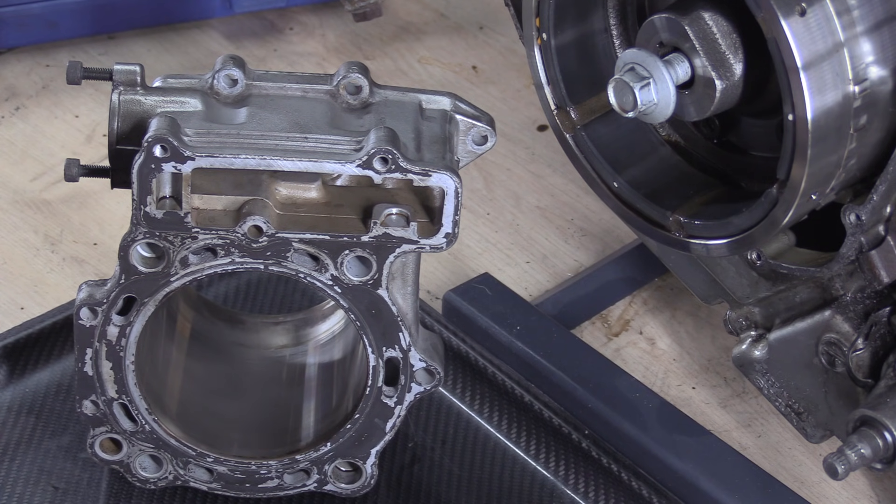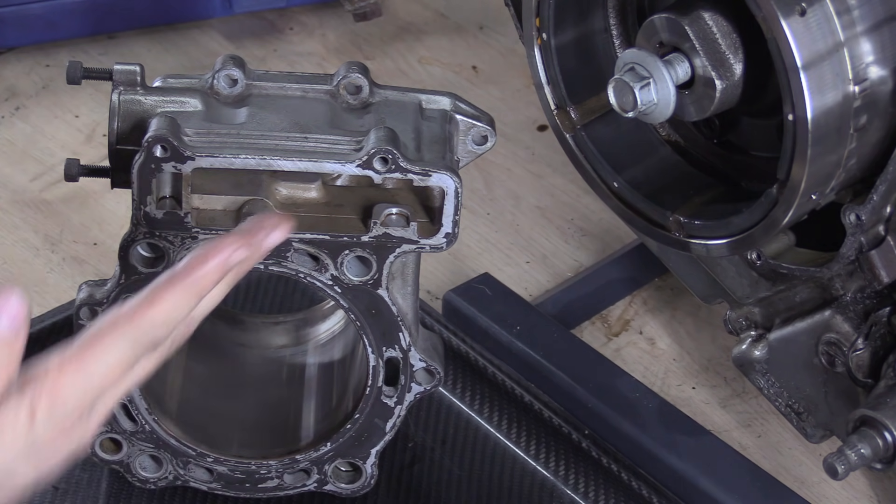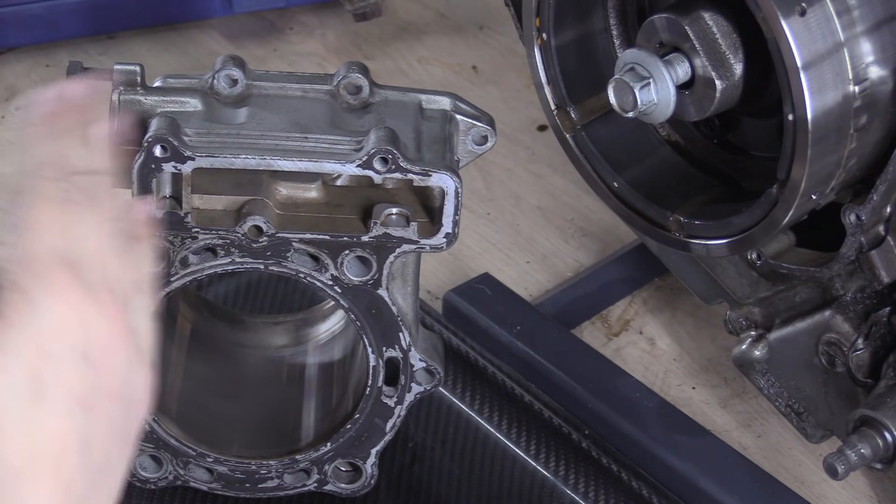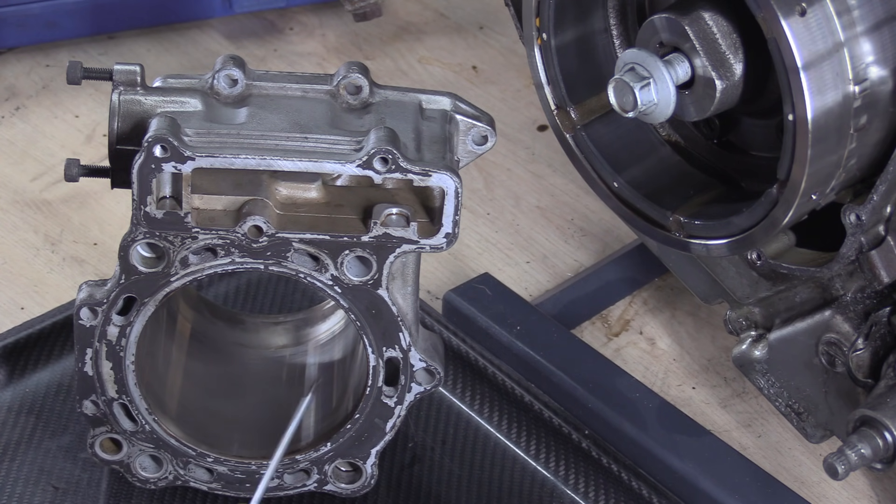The main reason is the piston goes through a rocking motion, so you're going to get more wear front to back than side to side. And you're always going to see that — you'll never get rid of it either. Things just wear. It doesn't matter if you made these out of extremely hard materials, there's still wear, because things are just imperfect. The structural bonds of atoms aren't perfect.